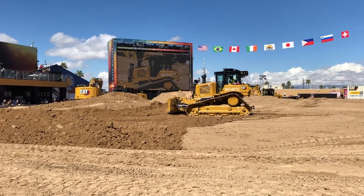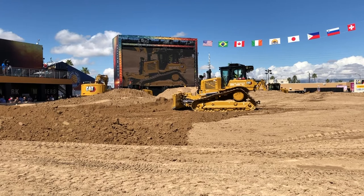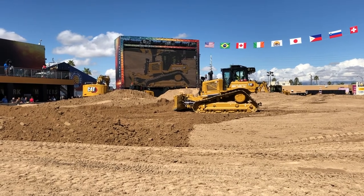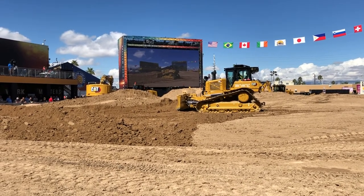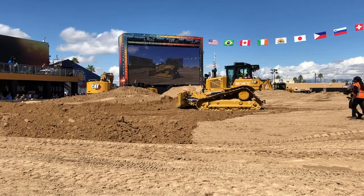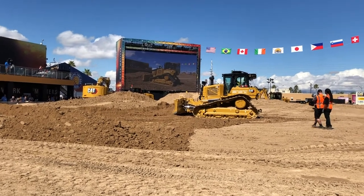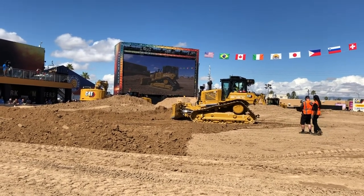Basically, I set my points in the direction I want the design to be. You can see there's a bench heading required, so I bench that heading. Now it's going to have to bench my elevation. I've got that bench. So I'm going to basically create a ramp here in front of me on this pile. It defaults to level, and I put my 10% in.